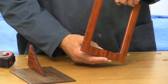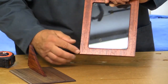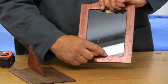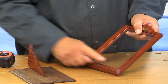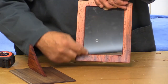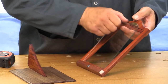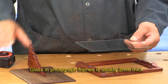When I started to make this I thought I would have some little feet at the bottom made out of the same piece of wood as the main frame, but I discovered there was a weakness in my piece of wood — a very minor structural fault. So what I've ended up doing is putting a piece across here with the grain running that way, glued on, which supports the front piece where the grain is running vertically. I changed my ideas as I went along to match my material.